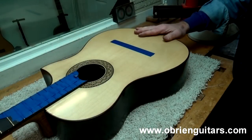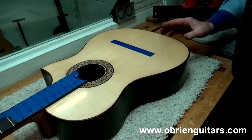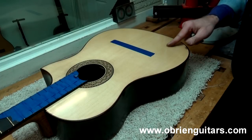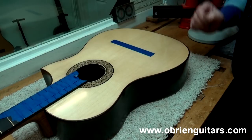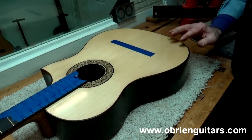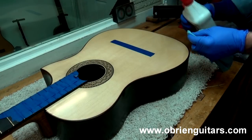The first thing you'll probably want to do is sand it all the way back to bare wood in that area — don't do that. Resist that temptation, because if you do you're going to have a lighter colored area, a blotchy area, and it's going to show up even worse. So right now, leave the finish on and don't take it back.